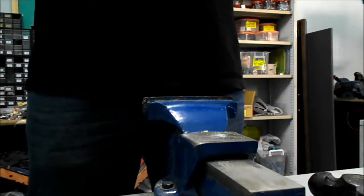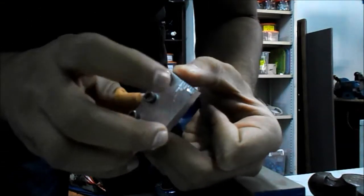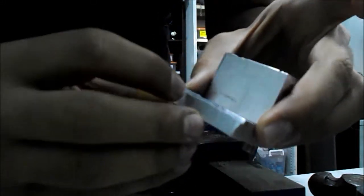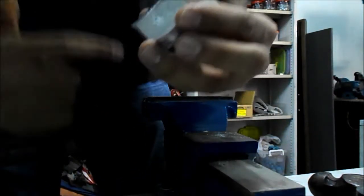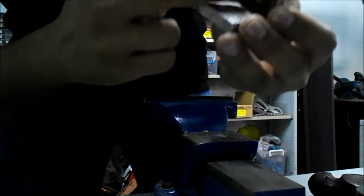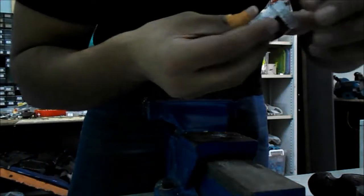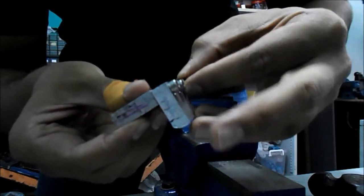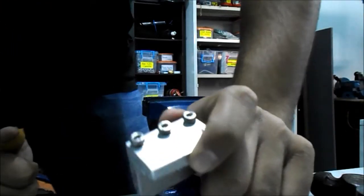As you can see, there's not a lot of deformation on 6061, but the plate has bent at its end. The part held by the vice machine has some scratches, and the edge has a slight bend from the impact force. The screws on 6061 are still pretty tight — you can't move them easily. For 7075, the screws were a bit loose, possibly due to the threads. That's it for the second test.